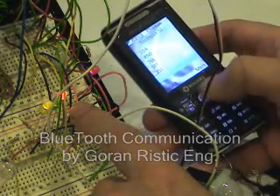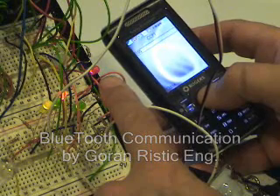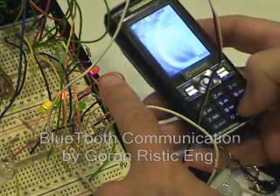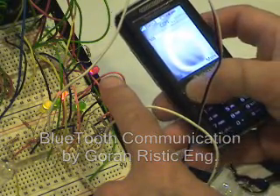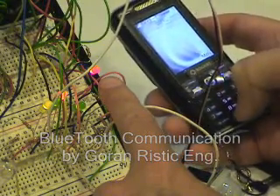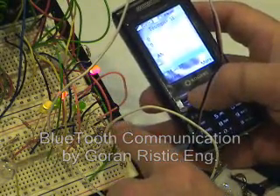Let's go back and change the value of this red one. Right now it's 100, sent between zero and 1023 — 100 gives brightness of roughly 0.5 volts or less. If we change it to 500, which is the middle or 2.5 volts, this becomes half brightness. Then if we change it to 1000, it will be almost maximum brightness — double — there we go.